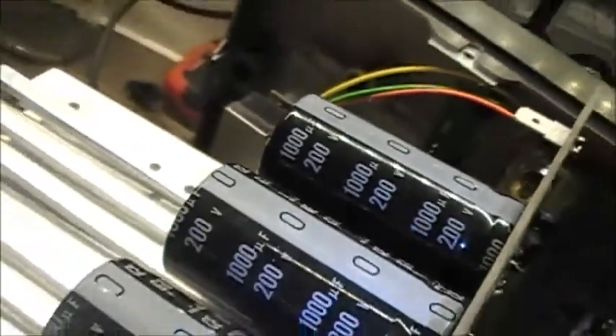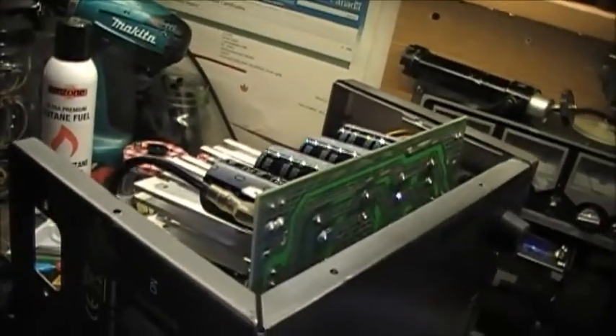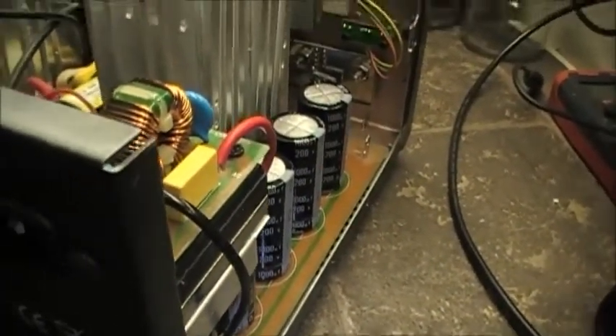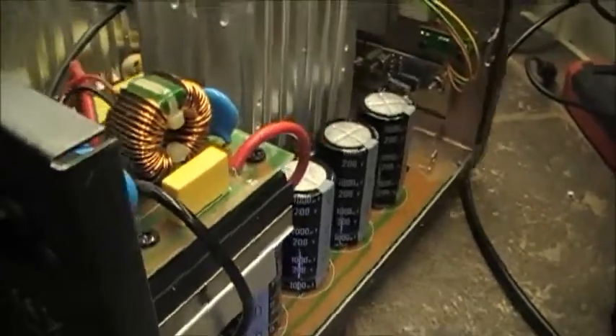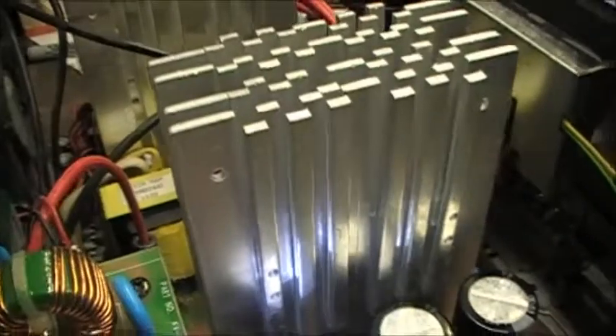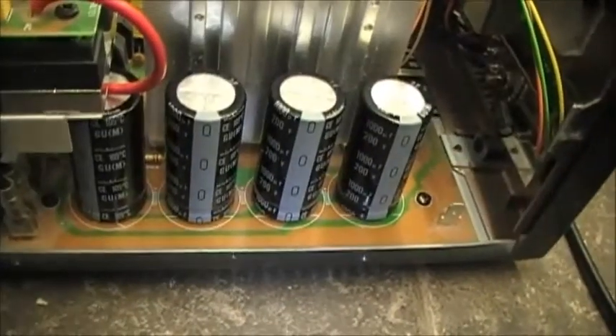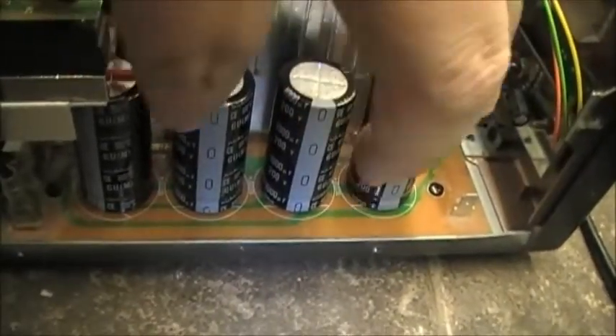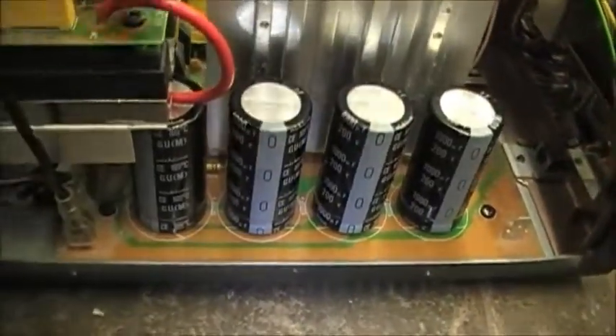Now I'm trying to weasel this circuit board back into place — going to be fun. I've got the board remounted, capacitors have been changed, and I just tried her out. So we have more capacitors here sizzling besides these four, but these four are now actually dead quiet — so these four are actually good now.